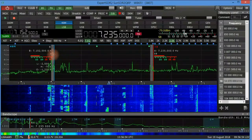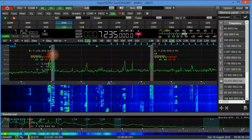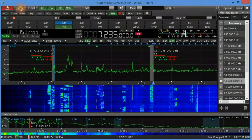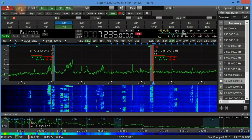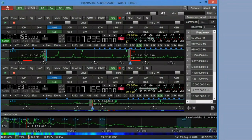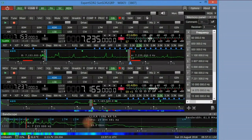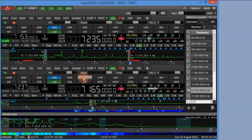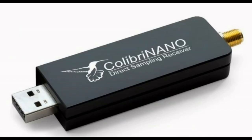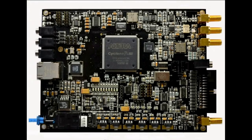What's common among SDRs is that beautiful, highly detailed spectrum display and waterfall, sometimes called a pan adapter, with handy features like drag tuning and click tuning. SDRs have variable digital receive filters with very steep sides. Never buy a $100 roofing filter again. They are full-featured with everything you'd expect in a modern radio and more.